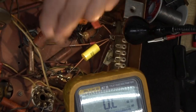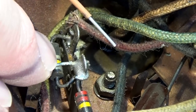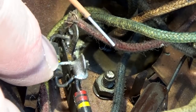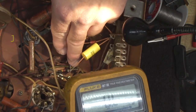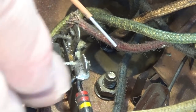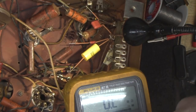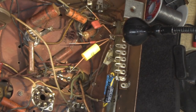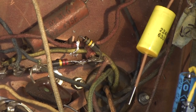Since I'm doing that, I'll go ahead and install this capacitor at the same time — it actually goes where this little wire nub is because I cut this old one off. Sometimes, not that often, I'll use the corkscrew method. I know it's a perfectly good connection, but I personally don't like the way they look. And unless it's going to damage a component — like if I were going to leave that resistor in, I might do the corkscrew because I don't want to get that resistor too hot. But most of the time, I'll go ahead and soak the solder out and replace it. That's a personal preference. As long as you get a good electrical connection, it really doesn't matter. Let me go ahead and do that, connect all these capacitors up, and then we'll get back to business. Let me add to what I was just showing you with these capacitors.